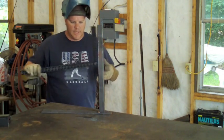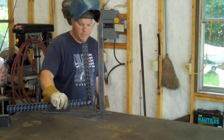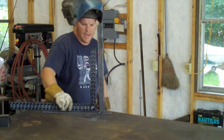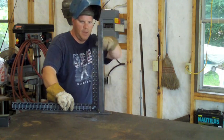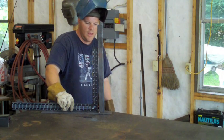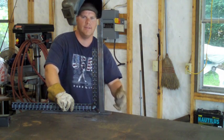I'm going to let that cool for a second. I don't have a notch cut out of my square, but look at it — check this out. I got the square flat and I'm hitting up here at the top corner. Check out that gap right there at the bottom. That's how much that thing moved because I didn't put a tack on this side.